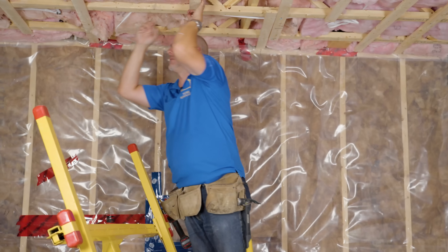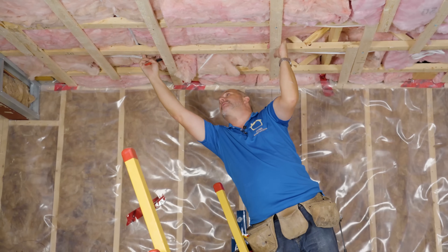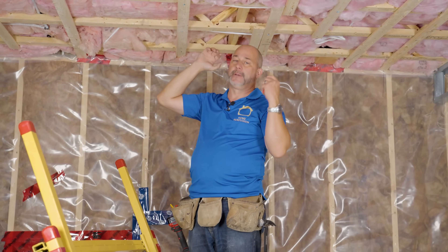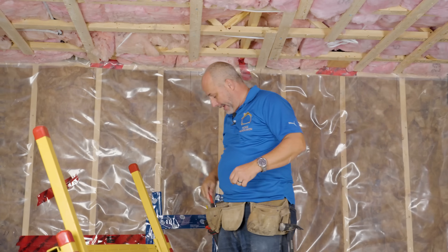You also want to take a look for plumbing lines one more time — just visualize where your lines are on top of the strapping. Make sure you're not using screws that are too long for the job just because they're handy. It's the wrong time to use a three-inch screw. Get yourself a drywall screw that's one and a quarter if you're using half-inch drywall, or one and five-eighths if you're using five-eighths drywall. You want to keep it the right size because there is a building code for how we do mechanical work, and you don't want to accidentally penetrate a water line or electrical line and wreck one of your circuits.